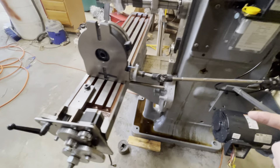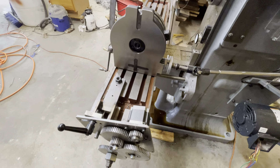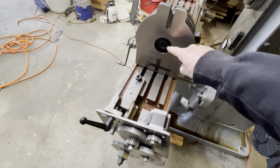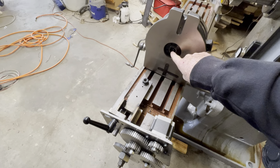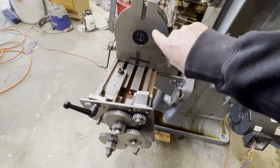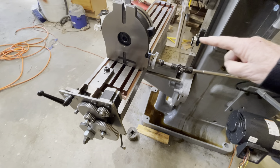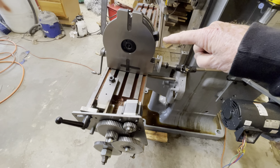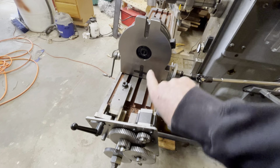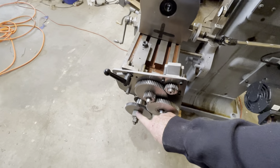Ultimately when this is done, I'll have a custom-made spindle with a differential gear that will let me make oddball gears, and I'll have a mechanical drive train from the spindle back to this little machine I made a few years back for controlling the position of the table. Whatever the operating ratio of the hob system is, every time that spindle goes around once I want the table to move forward about five thousandths of an inch, so I need a 40-to-1 ratio between here and this lead screw.